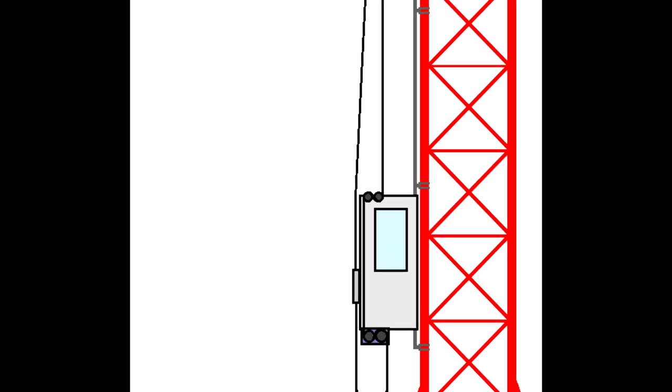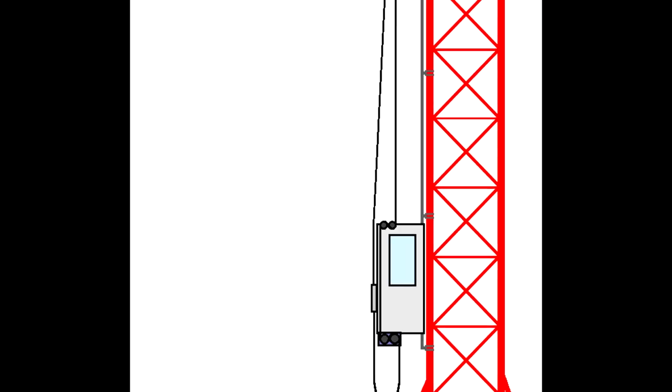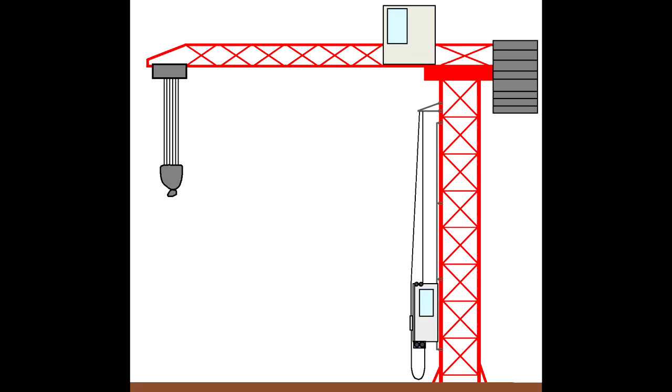The first cable, the main cable, is not attached to the lift. It actually goes through a pulley wheel on the lift with a motor. So this is a direct drive lift, not a climbing lift, because it does not climb up a rack and pinion. It's a direct drive lift, like the Schindler direct drive. The motor's on the lift and runs as a traction wheel, mounted to the lift, and pulls the lift up the cable. It's cheap, nasty, has a capacity of 200 kilograms, maximum of two people. The lift cab is absolutely tiny. You can barely fit one person into it, and it's all round bad.